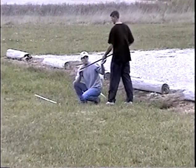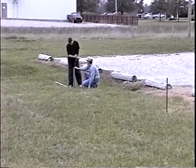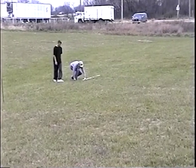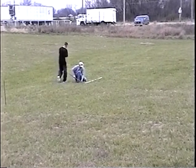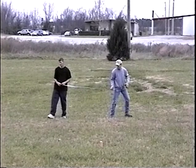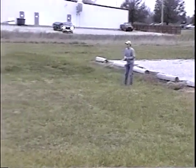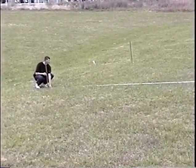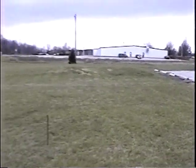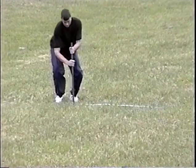And we will tap in another stake on the corner where our middle section begins. If your tent is round with no middles, you will already have these stakes at locations 4 and 3. We have one middle, so we will use our diagonal F measurement between locations 3 and 6 and 4 and 5 to see if stake layout is on the square. Move stakes as needed.